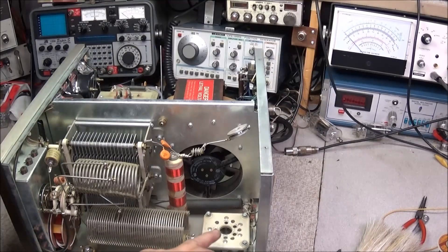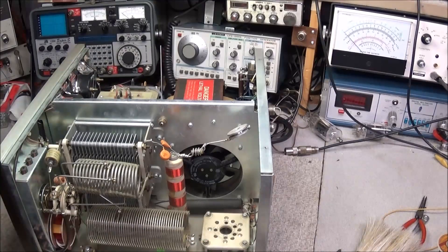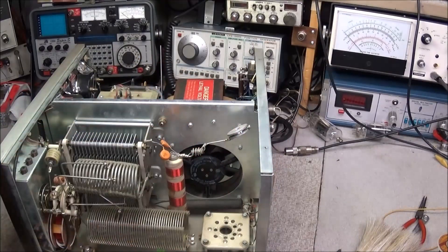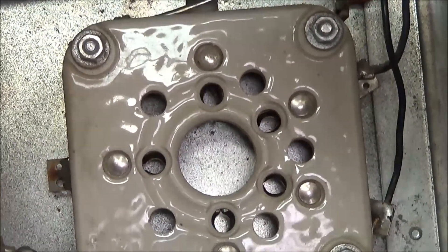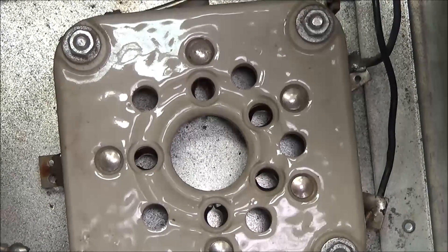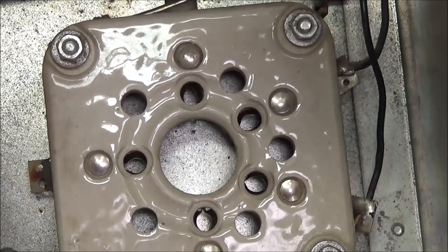Then we're going to get in here and look at this tube socket real good, just to make sure it's not a connection issue. What happens is it's like a little U-shape connector with a clip across it that holds it together, so when the pin goes in it's tight. But a lot of times it'll get loose connections, these things will start corroding, get hot, and they'll open up on you. Not seeing anything out of the ordinary - the contacts all look good and clean, and they all look nice and tight. That doesn't seem to be a problem whatsoever.